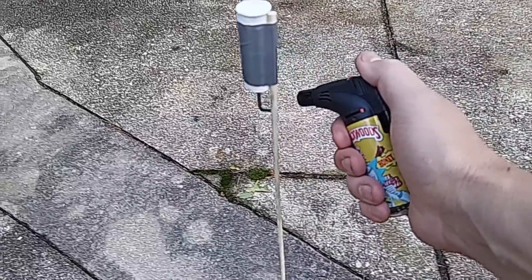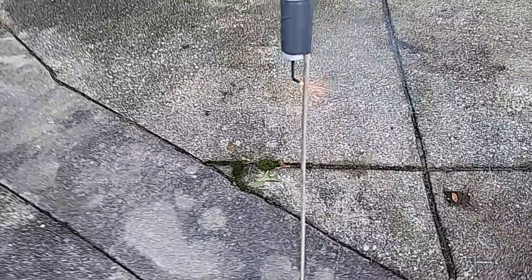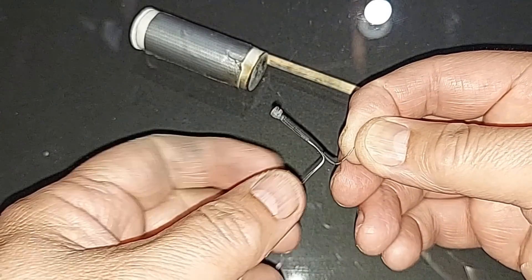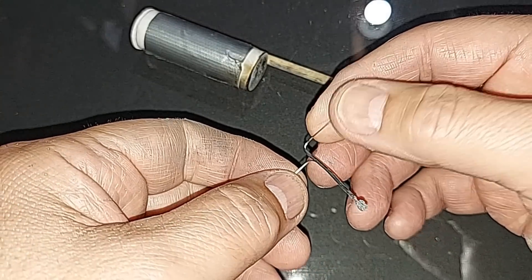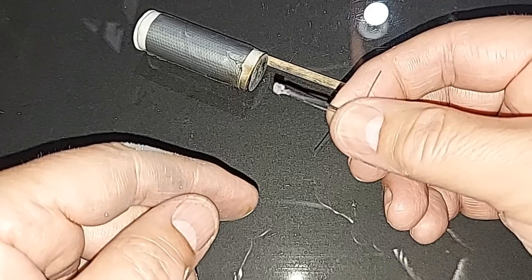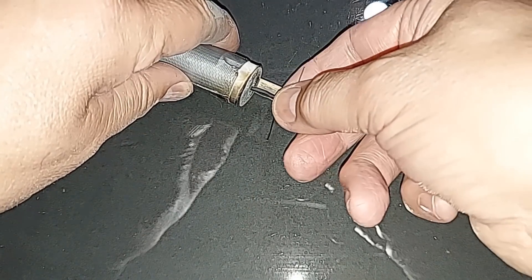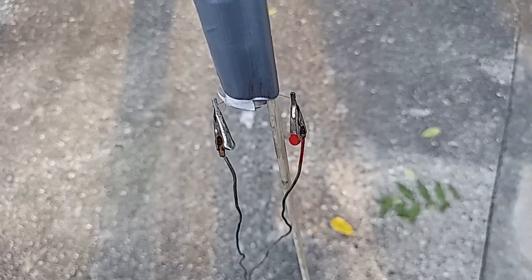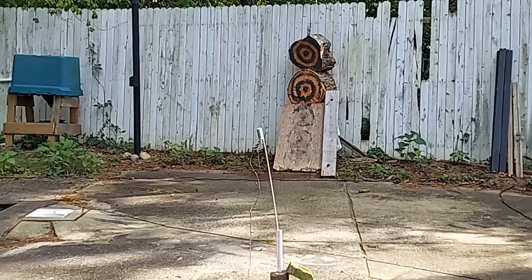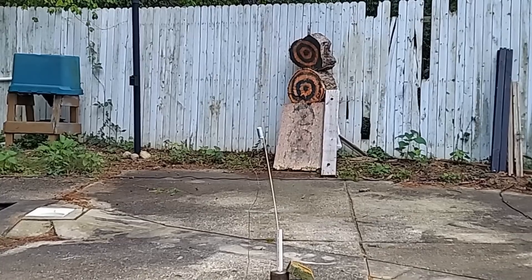Let's try again with the new magnesium-coated fuse. I also have an Estes igniter — I took the tape off and put shrink tubing on one wire to insulate it since both wires had to be pushed together to fit past the nozzle. I again dipped it in super glue and magnesium to give it extra bite. Simple setup: wiring going to a battery and a switch. This rocket engine contains 16 grams pure MnO₂, 6 grams battery MnO₂, 4 grams aluminum, and a 5/32-inch nozzle.